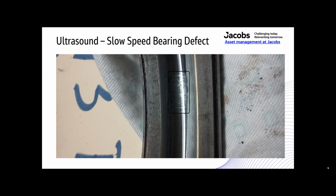The damage shown on the bearing doesn't look like much. In a dry bearing, as this one was, with a big load on it, the rolling elements continuing to roll over that spot would have continued to peel the material from that area until the equipment failed to operate. Even as small as that is, the failure would have happened.